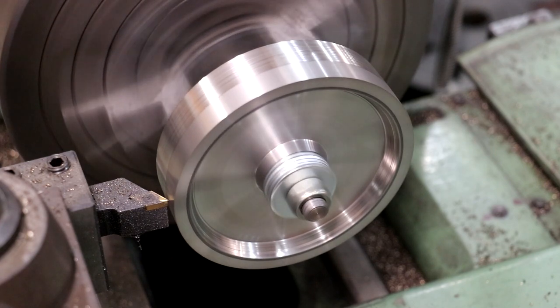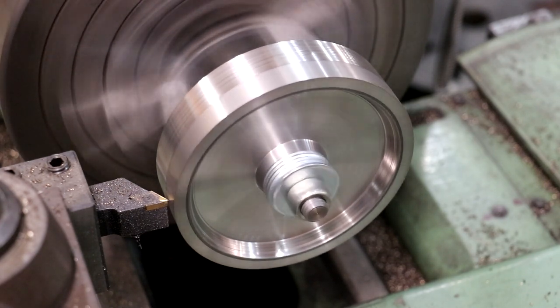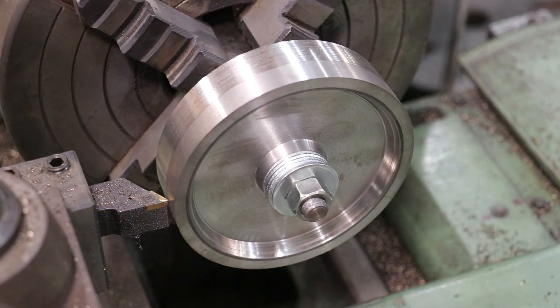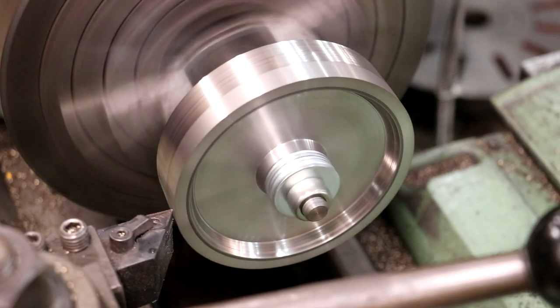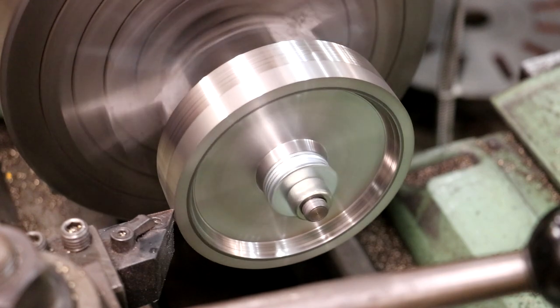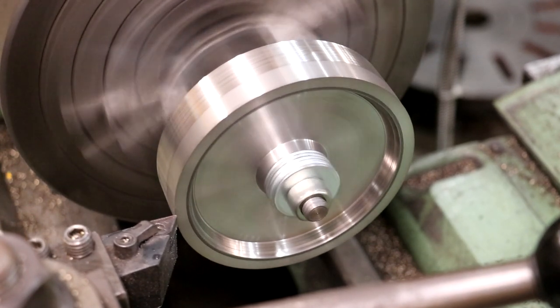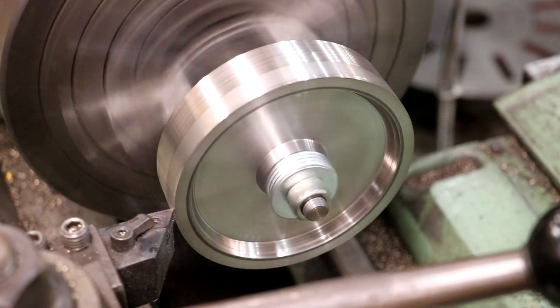All right. First side down, let me change my taper and put a different cutter in there and we'll get it from the other side. All right, tilted 2 degrees the other direction. And again, just kind of touch off there. And start cutting here.